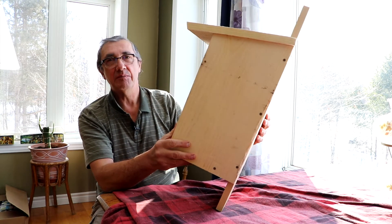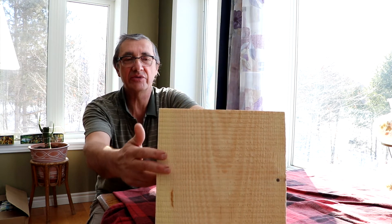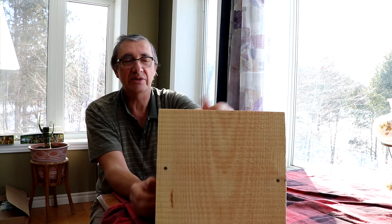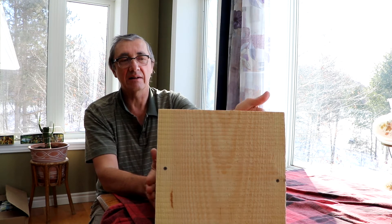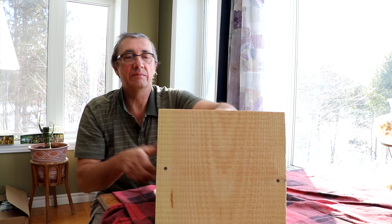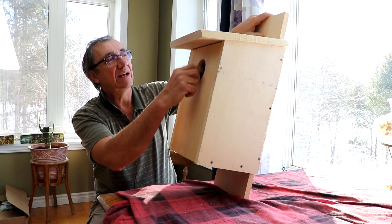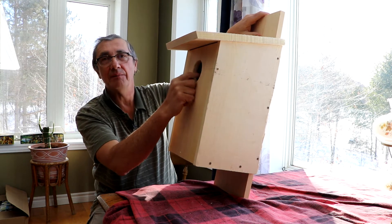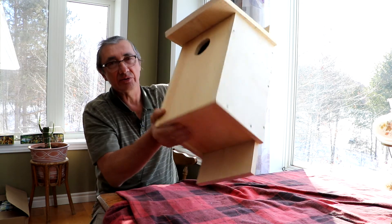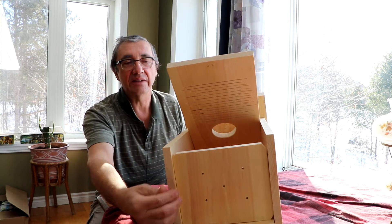Because I altered this plan a bit from the original, I had to use a wider board for the roof — this is actually 1x12 rough pine for the roof, just to cover the greater width now that I was putting the front board and the back board in between the two sides. The hole itself is centered at the 12 inch point high off the floor. I also recessed the floor about a quarter inch from the bottom, which just allows rain to drain off from the sides and the front.